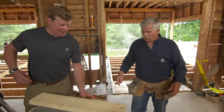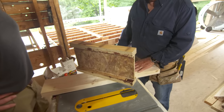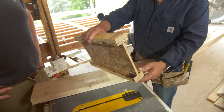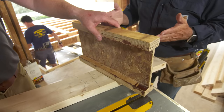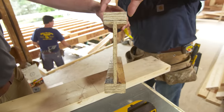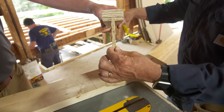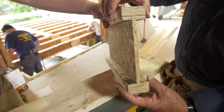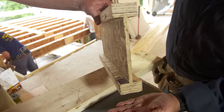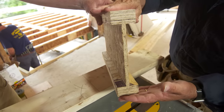You like your engineered lumber — you get the benefit of the fact that it is strong and straight and true. This is actually just a little bit bigger than a conventional 2x10, a little wider and a little higher. Think about this as an I-beam: if the core is higher, or the flanges are further apart, the distance they can span is greater.